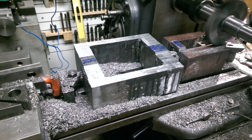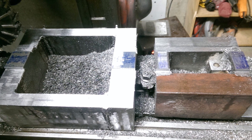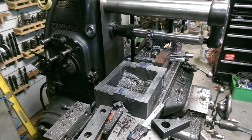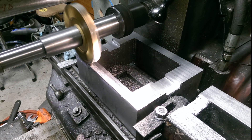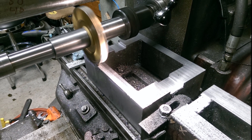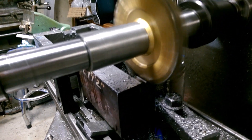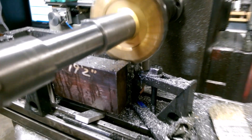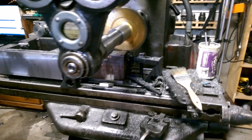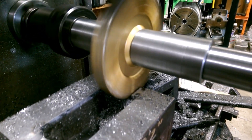As you can see, I left in the center a little tongue that registers the headstock and the tailstock to the bed of the wood lathe. There's a tongue on one side and a groove on the other. I couldn't really figure out how to register the groove first, so I ended up cutting the tongue first and then using parallels to mount it and square it up, to make sure that the groove is in line with the tongue and everything was squared up when it was all mounted back. It took a little fiddling, but it looks like it came out pretty good.